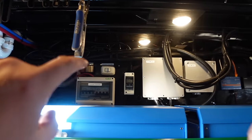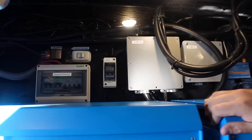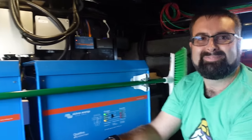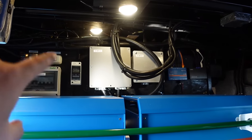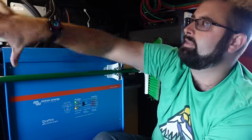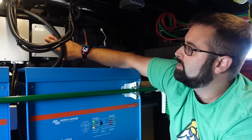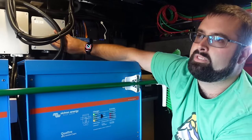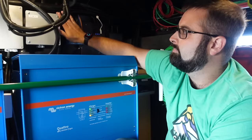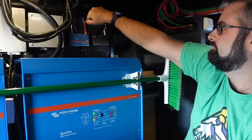Next over, basement front lights — that just turns these lights on and off. Then we've got a 30-amp buddy plug, which is a circuit breaker for the electrical outlet that Brian's rig is plugged into. All of the incoming shore power — the 6/3 wiring that comes from the surge protector down to the Quattros — has to split and come back together, and it's all in that junction box. So that's 50-amp AC. There's also a 30-amp AC because that's where the generator wiring comes in. I don't have an onboard generator yet — they were backlogged by about a year — so I use a portable one.